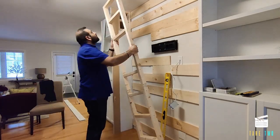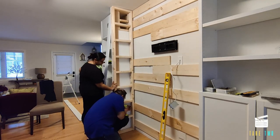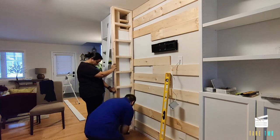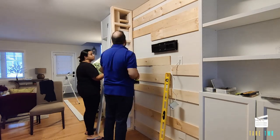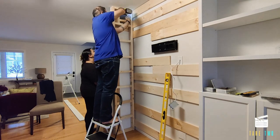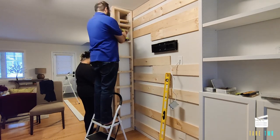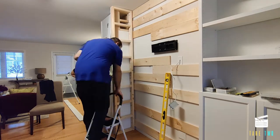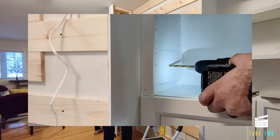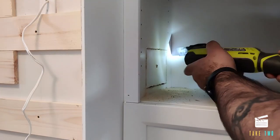We made sure that we had ample support in the middle. Putting the frame on the left side wasn't challenging — we made sure to use construction screws and screwed it to the one by six which we had attached to the walls. The screws had to go in at an angle, which was a little challenging, but in the end I could screw them easily using my impact driver.